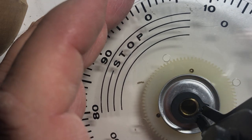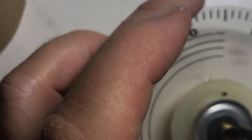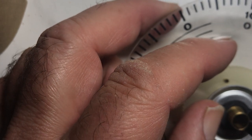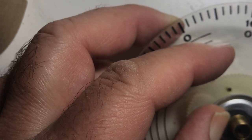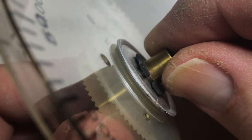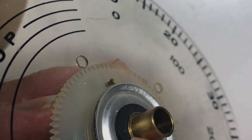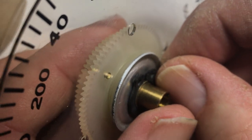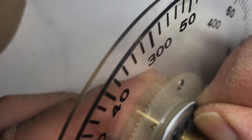Let's do this clippy thing. I'm going to hold it down like this because I need to have that gear proud. Let's now do it again with no disasters. I felt it go on. Now we're going to make sure this thing is level and true. The back of it is a bit not level here. So give it a little press — you just want to get it to be level. This thing has tension on it. A tiny press — don't break anything, don't hit these. I can't do it that way, so I'm going to tap it with a screwdriver.